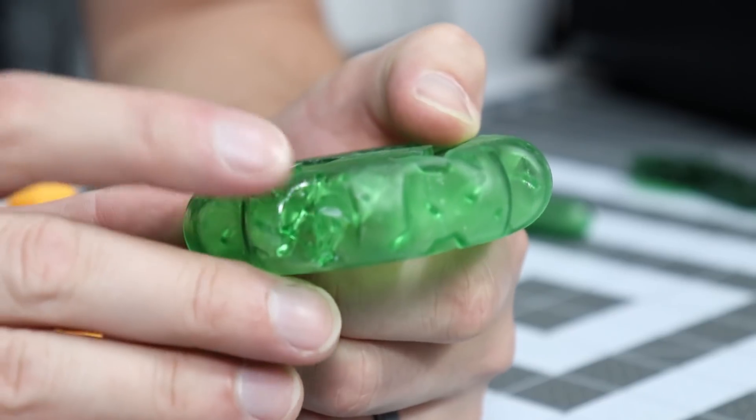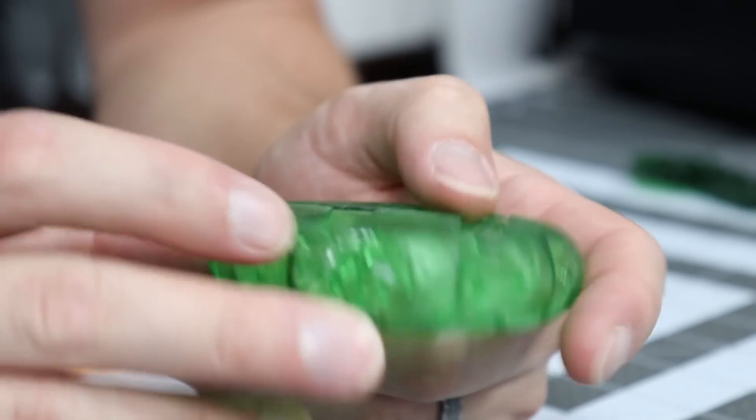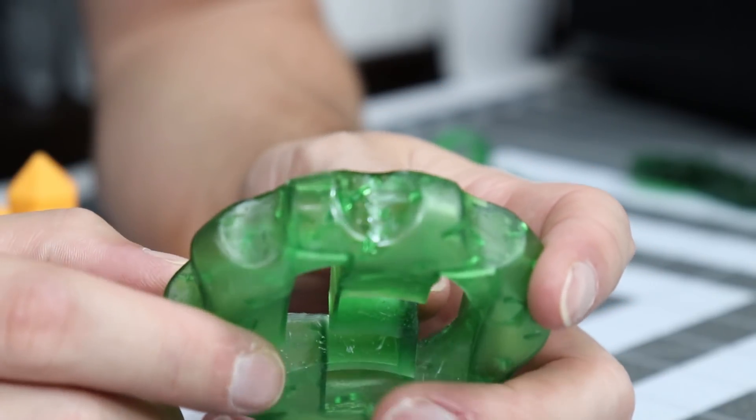I definitely could have done a better job checking it before printing. I added a hole at the bottom but it was too small — about two or three millimeters. You need to do at least five millimeters on hollow prints to get the resin fully out. You can see this part here is a little more shiny because some resin was on there and had cured over the top of it — that's just what resin does.